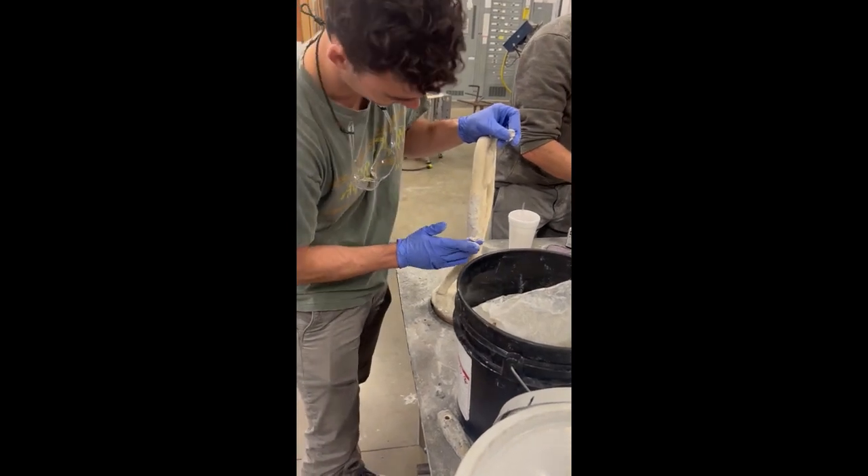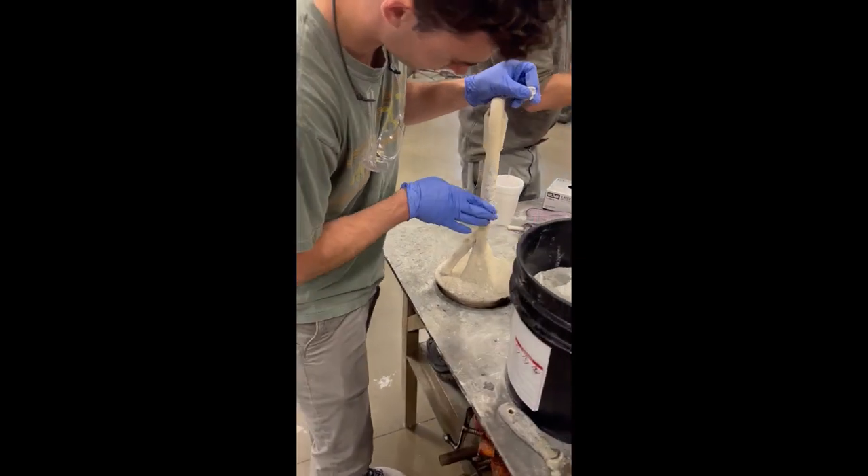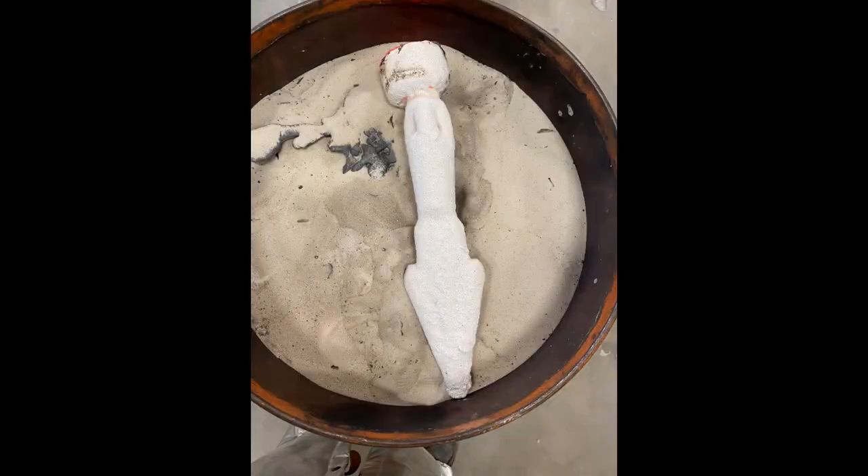After this shell comes out of the burnout furnace, we can see Colin here doing some patchwork on the shell. This is a different spear, but it lets you see our fluidized bed that we use to bury the ceramic shells after they've been preheated and prepped for pouring.